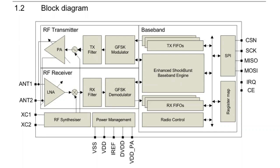modulation. If you have more amplitude, you cause more deflection from whatever energy you're using. So if your energy is coming from the pressure wave of sound and it impinges upon a microphone, you can use that to deflect a needle that carves out a groove in a record. So if you actually have a physical LP turning and you take your fingernail and you touch it to the grooves, you can actually hear the sound coming out because it's baseband modulated onto the plastic, or I should say the vinyl of the record. So that is a baseband modulation.